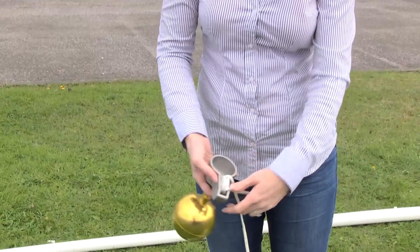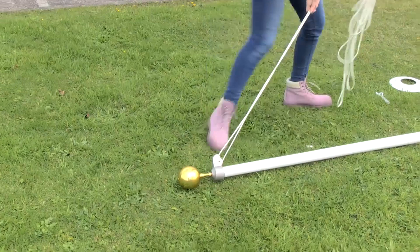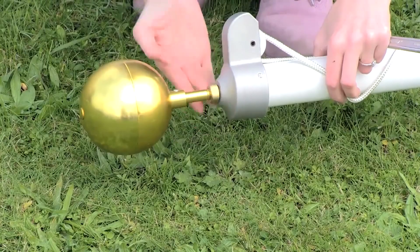Next, you need to attach the ball finial to the truck. Leaving the locking nut on the ball finial, screw the finial to the truck and then thread the halyard through the truck and bring the two loose ends together. Place the ball finial and truck on top of the mast and secure the aluminum ring at the tip of the mast. Then tighten the lock nut provided on the ball finial to the top of the truck.